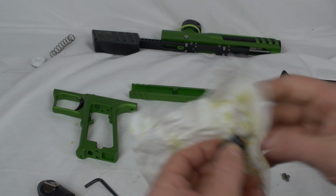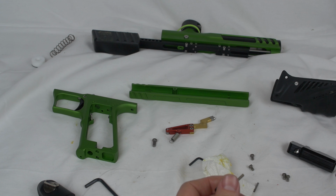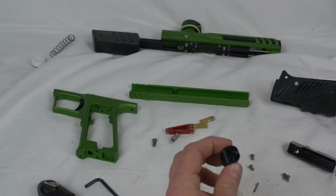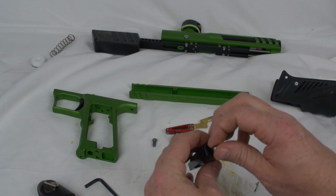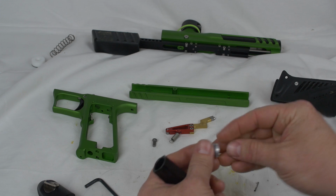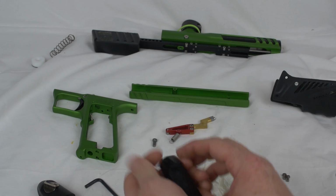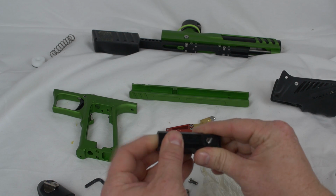So we're going to check our O-rings here. Give it a little bit of lube. So we got another O-ring here. When you're going back together, we put the big O-ring in first. Make sure that's fully seated. One way to make sure is to make sure you can see your ball bearing right here, and make sure everything's pressed down against it.